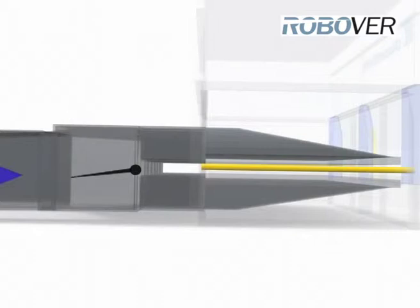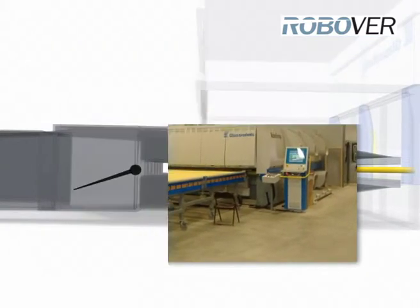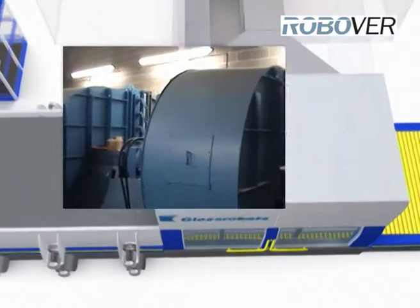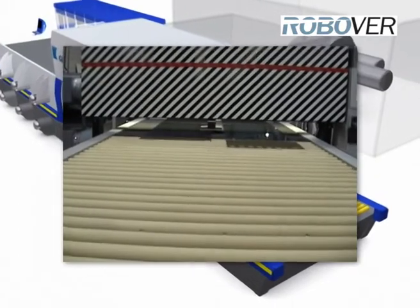The air is being led via the main air channels to the chiller. The channel includes an air balancing plate for controlling the top and bottom air flow. The blowers are inverter controlled, thus giving smoother and more precise control. When the glass achieves the desired temperature, it moves on to the unloading table.